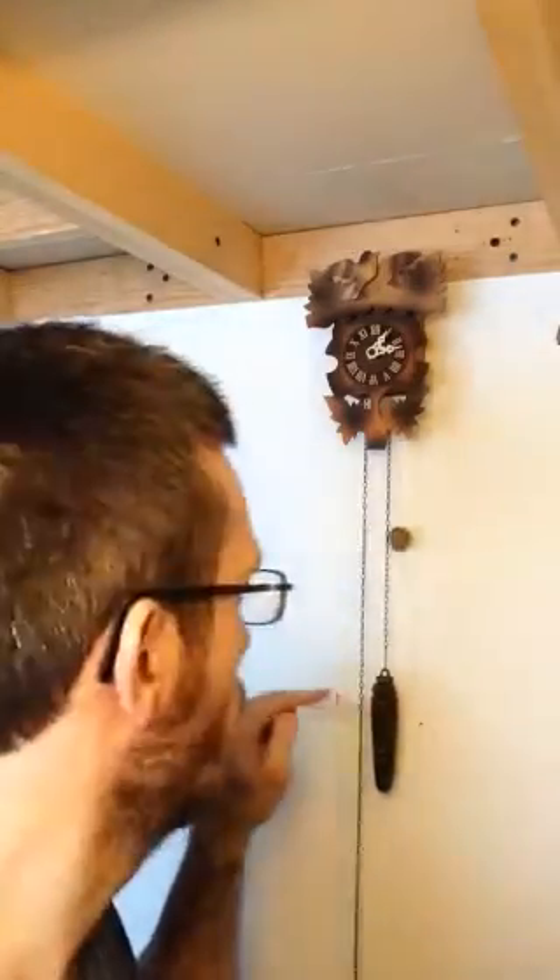What is the escapement mechanism? Well, the escapement mechanism is a mechanism that takes periodically some of the potential energy stored in the weight here and transmits it to the pendulum. Why is this necessary? Well, if there wouldn't be any energy added to the pendulum periodically, it would eventually come to a stop due to the air friction and other mechanical losses in the clock itself.